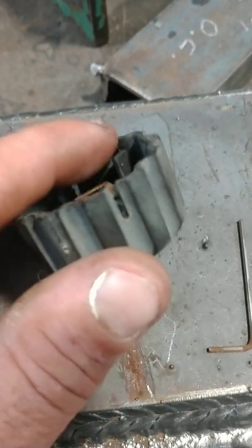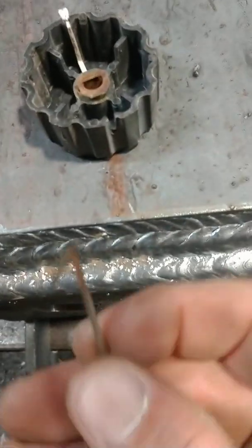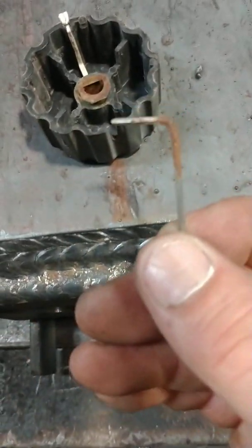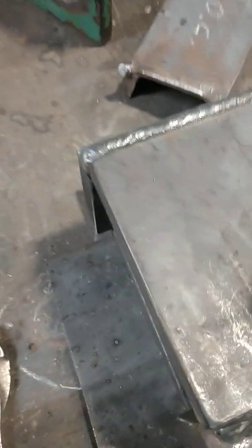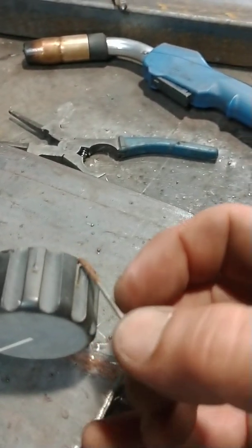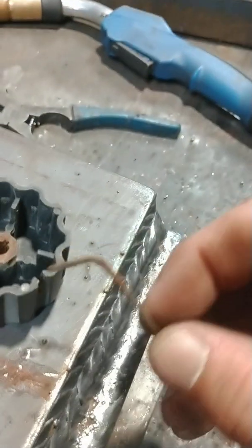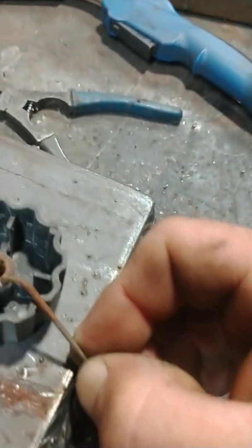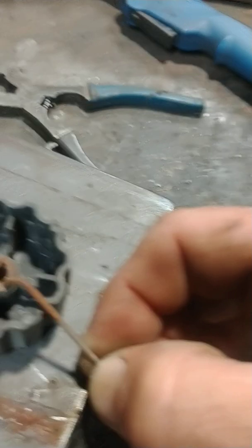So the way to get this off — you'll notice there's a slot opposite of your position indicator here. What I did, I just took this little tiny Allen that I never used for anything else and it fits in this slot. You can put this Allen through the slot and just pry a little bit, just apply pressure to that. Once that is straight and parallel — or perpendicular — to the shaft, you can just pull the knob right off.